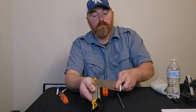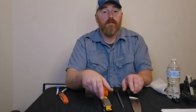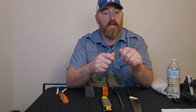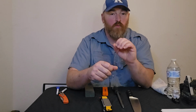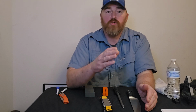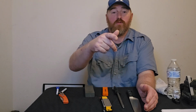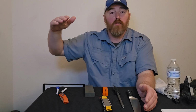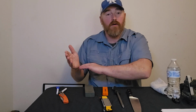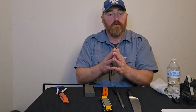Have you ever noticed that you sharpen a knife, you do everything you can and you got it sharp, but for some reason it's still catching on paper, or it's not that razor sharp, and you put all that work into it? I wonder, are you stropping it? Are you doing that final step of stropping your edge? Because if not, that's why. You're still catching on the paper because you haven't polished that edge and given it that last step of that strop, which is what you need to make it a razor.